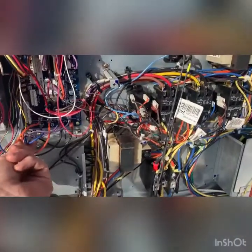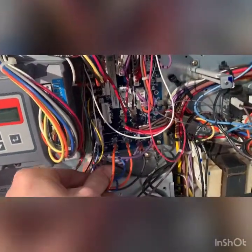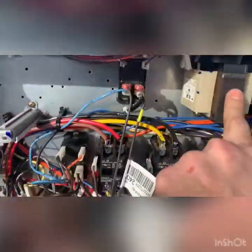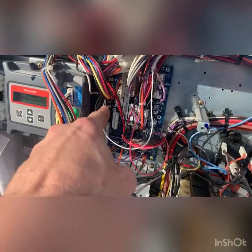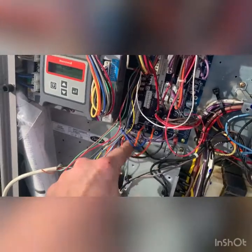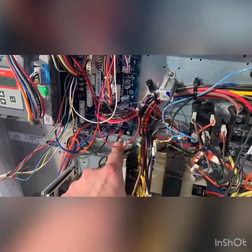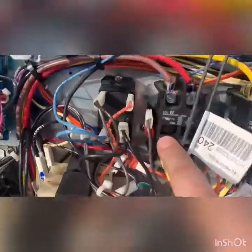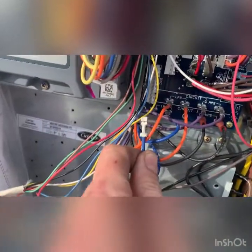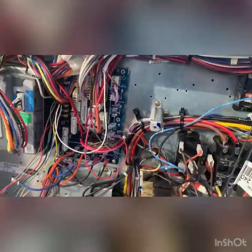What we did was disconnect the low pressure sensor. The 24 volts leaves the board, runs down to the thermostat, comes back to yellow, then powers the low pressure sensor, leaves and comes back, then goes to the high pressure sensor, leaves and comes back - power must make that whole journey. But the system is running with the low pressure sensor disconnected. If we try to connect it, it trips out.